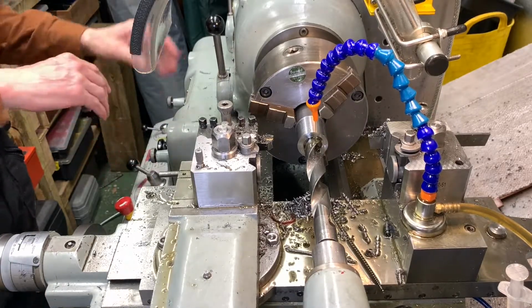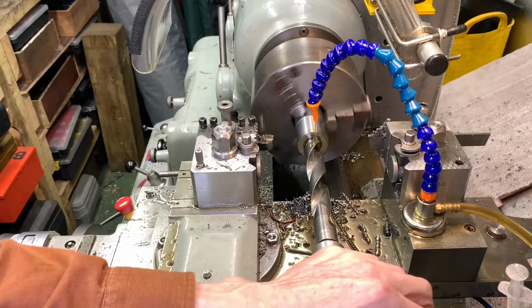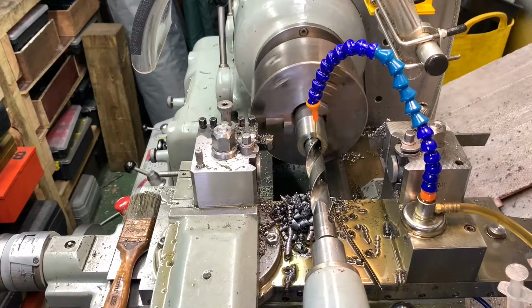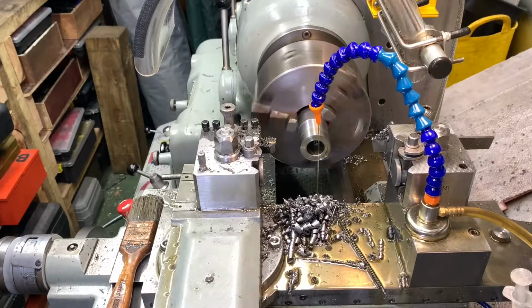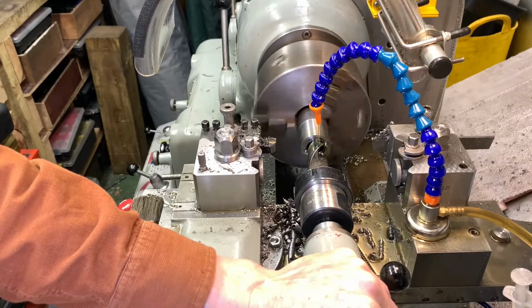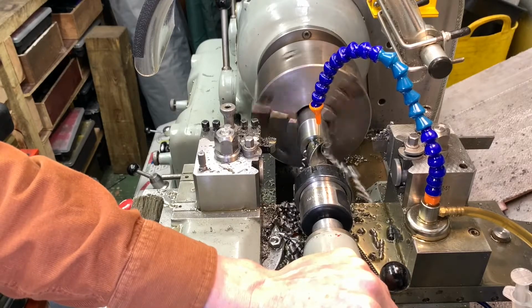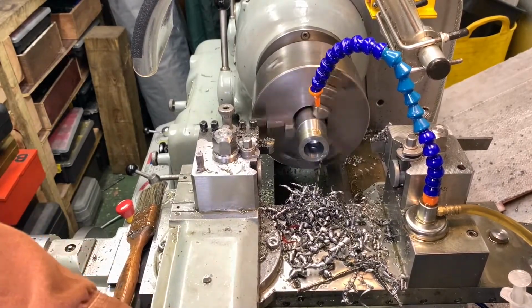244, so I'll go for slowing it down. So this is 164. Right, well, we've slowed that down now, so I'm wondering if I get this big boy to go now. Just feather it while it establishes its diameter. I just had it going too fast, didn't I? Cutting nice and even on both sides, good grind. Alright baby, let's just keep the work cool there. Alright, so I reckon we're there on that. There we are. We've cleaned it out.